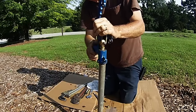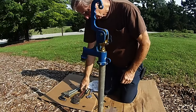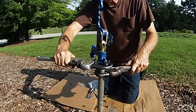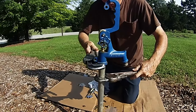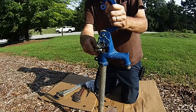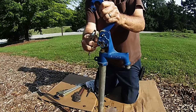Do not tighten the packing nut or the set screw and turn on the hydrant. With your two pipe wrenches — one on the pipe and one on the bottom of the head — tighten down the head until you can't tighten any further. Now that the head is tightened, tighten down the packing nut. Also tighten down the square head set screw.